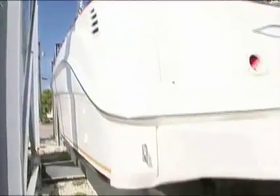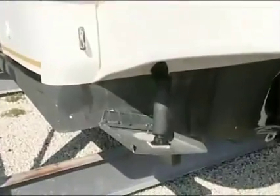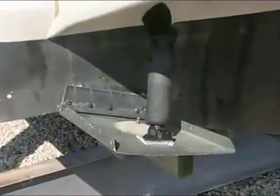Okay. You don't want to put the anti-foulant paint, though, in between the actual contact of the zinc coming in touch with the trim tab. Right. You want the zinc to touch the stainless steel. You want that zinc to get eaten away by the electrolysis. You don't want the stainless steel getting eaten away. So that's why you want to protect them.